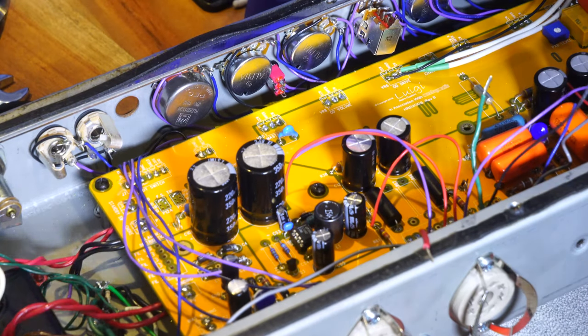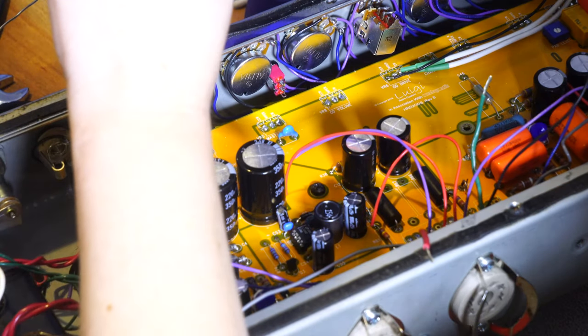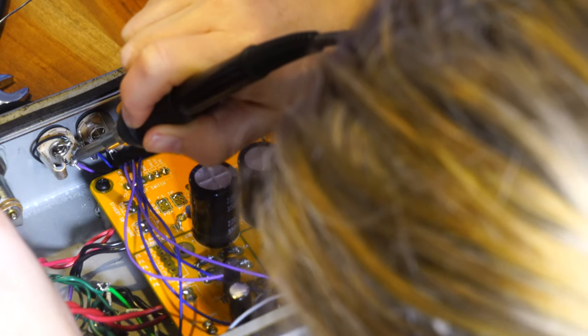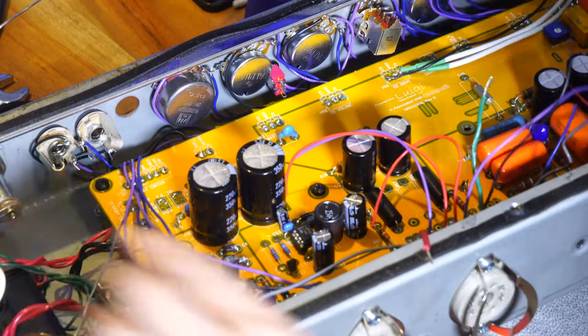You can put a little bit of fresh solder on it as well if you want. Just to make sure, because sticking through a hole and leaving it that way can sometimes lead to bad results later. Okay. So once you heat this, it'll sink back down a teeny bit, but that bend will keep it in place at the same time. There we go. Perfect.